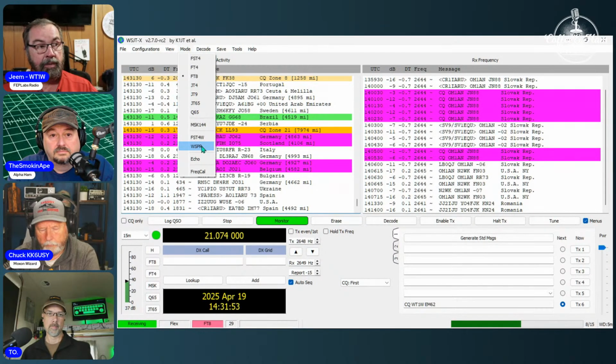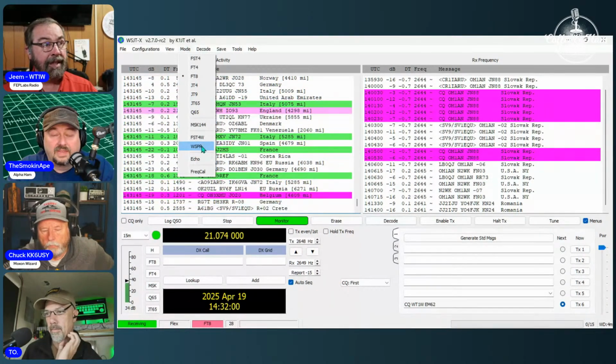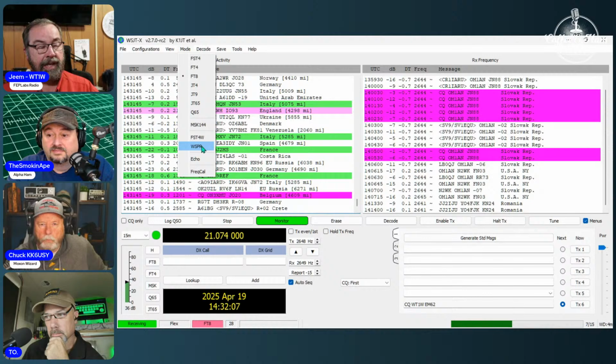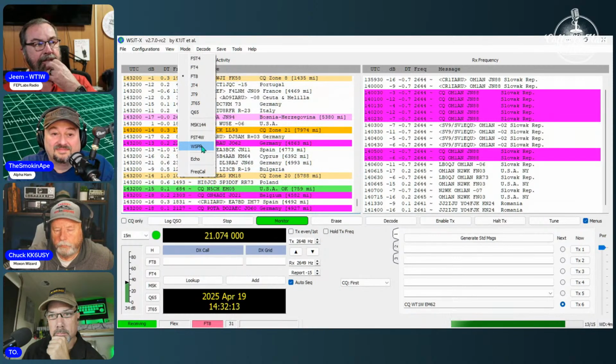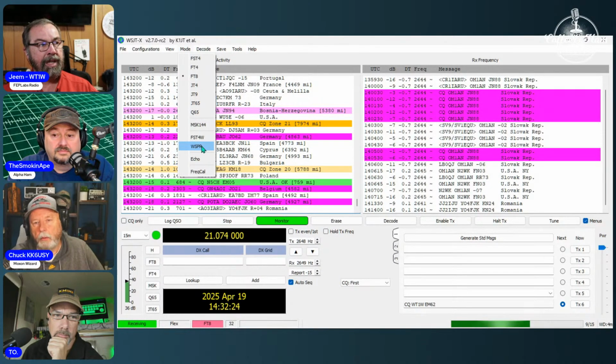And you want it set to low power because it is weak signal, and it's going to key down for like 2 minutes. And that's not like 10 watts, right? That's in the milliwatts is where you're supposed to be transmitting with that stuff. Yeah, the Zachtek box is like a quarter watt, 250 milliwatts. I've had a buddy of mine tell me that he doesn't think he could get his radio to go less than a watt, which is 4 times more than you need to be putting out on a WSPR. So that would be a case for an attenuator.